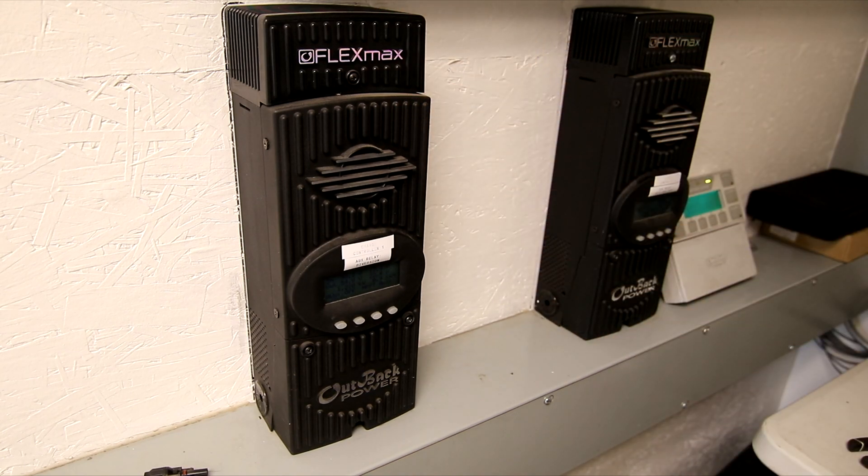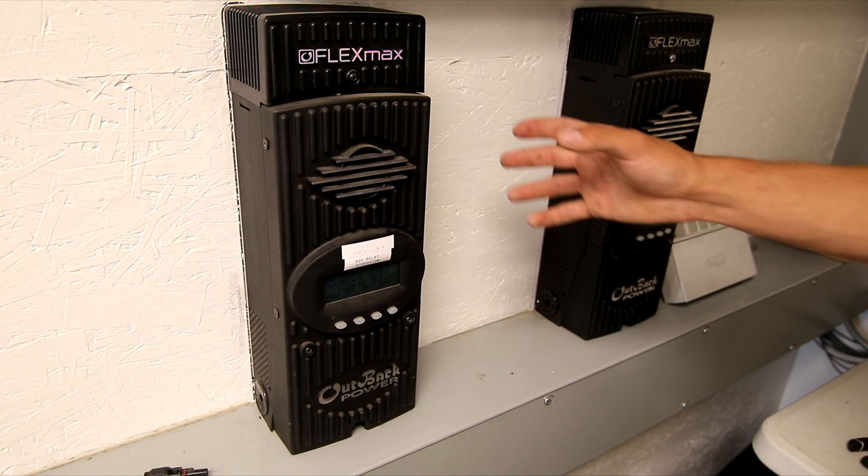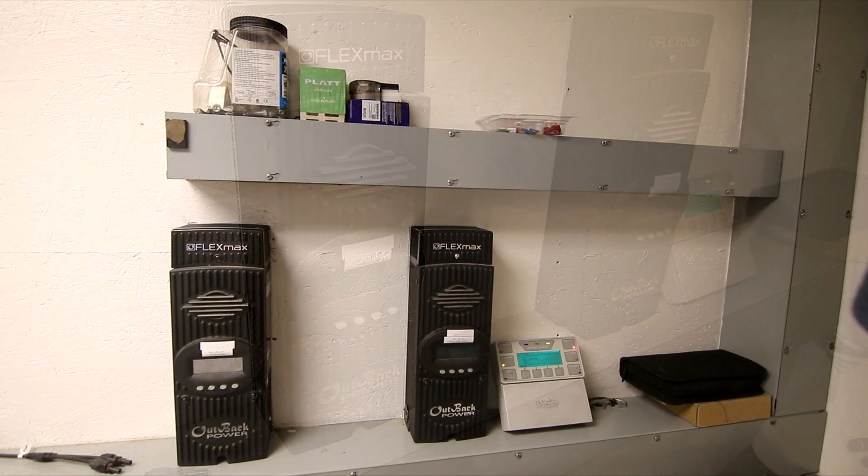In the evening I have the 80 amps capacity to the west. Even though the total amount of solar connected may be a little more than the 80 amps each controller is rated for, it doesn't matter — because with some panels facing east and some facing west, they're not all operating at once, so it still stays within the 80 amp rating, which is pretty awesome.